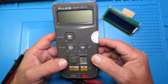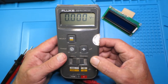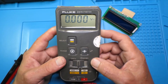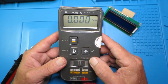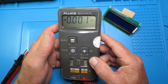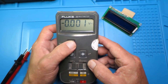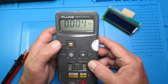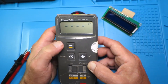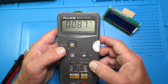Now after, say, 6 to 7 years, there's a fault — a very common fault that occurs with these multimeters, and also on later versions it happens on the LCD. The LCD on here is absolutely fine. But to change the range, for example from DC volts, which it comes on by default, to AC volts, we have to press the select button — which sometimes works and sometimes doesn't. Eventually it switches over but it's by no means reliable.